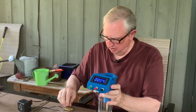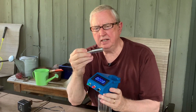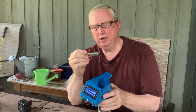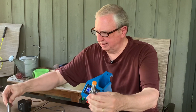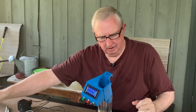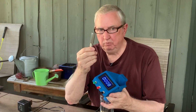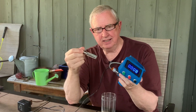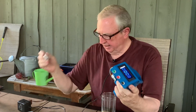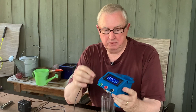One thing you will need in order to make it is this: an 18mm tap with a 1.0 pitch, the same size as the sensor. The threads are cast into the plastic, but you can't cast threads that accurately at that small a size. Having them partially cast in there makes it simple — you can get it going quite a ways with your fingers and then switch over to a socket wrench for the rest. I'll put links below where you can download the STL file, which is all you need if you know about 3D printing.